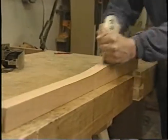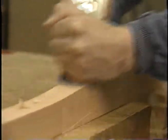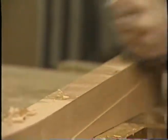The planing starts out pretty rough. There are a lot of little bandsaw bumps in the leg that you need to plane down before any real smoothing begins. But even in hard maple, the legs clean up pretty quickly. By skewing the plane, as I get into the area between the upper and the lower leg, I can plane a lot further into the curve.